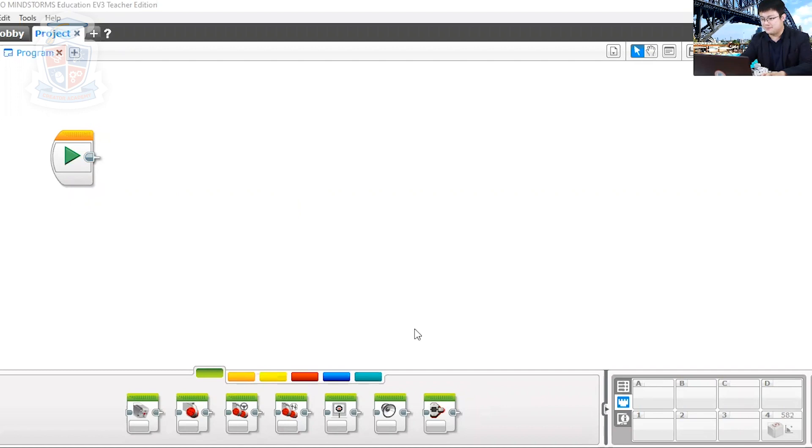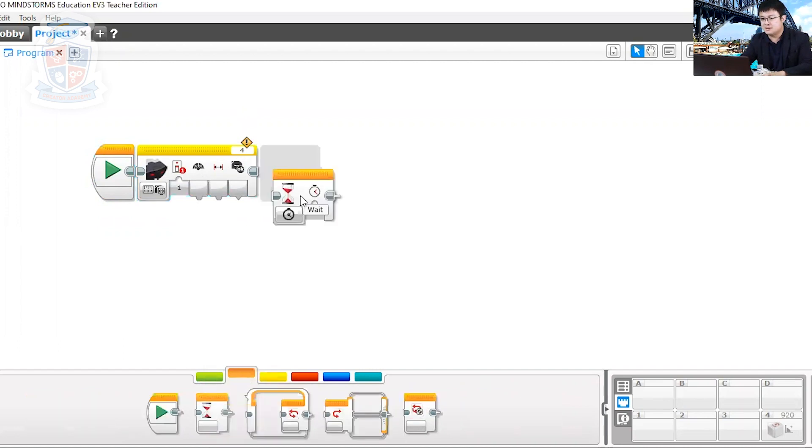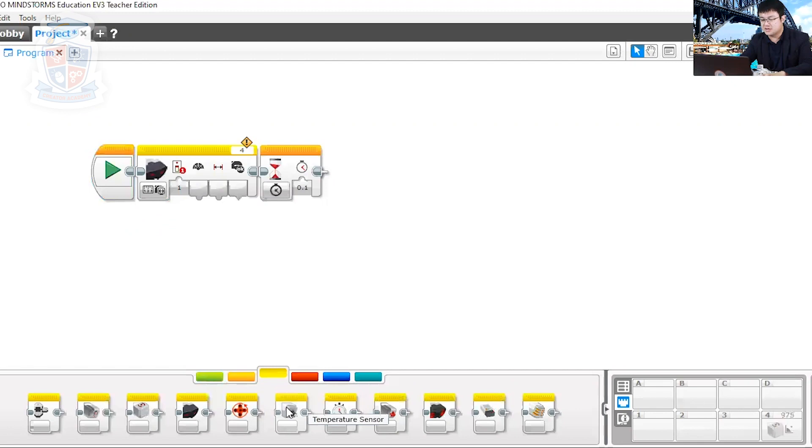As you can see down the bottom right in our port view, the gyro is drifting — this is the same robot as before. You've tried unplugging and plugging it in again and it's not working. So here, we try to trick our robot into thinking that it's got a different sensor in place of the gyro. In particular, we trick it to think it is an infrared sensor. So we set the infrared sensor to measure a beacon at port four, which is where our gyro is attached. Then we wait for a split second to re-measure our gyroscope.